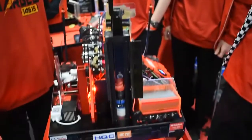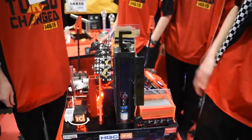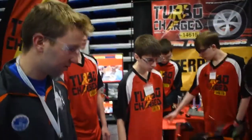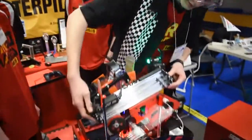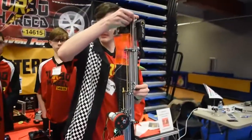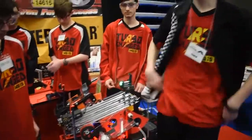You can pull it down, so we will latch onto the lander and pull the whole robot up. That's pretty awesome. And you were telling me about your gear mechanism for your linear actuator? So this one works when we have the linear slide go out with the bucket. Then this motor right here spins a small gear into this bigger gear, and that lifts it up. Gives it a lot of power and just more stability. So yeah, those are my two favorite parts of the robot.